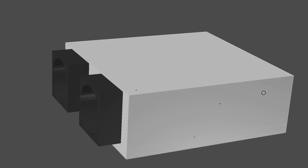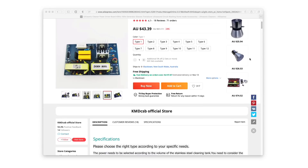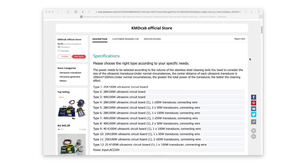One suggestion was to improve the cooling of these drivers by placing them into a smaller box with fans to create more targeted cooling. So I 3D printed a box, put two small 12-volt fans at one end and some vents at the other end, creating a wind tunnel. This was effective in bringing the operating temperature down, but I was still having failures, and some drivers were getting hotter than others. So I decided to try some different drivers. I found a new seller on AliExpress that sold transducers and drivers separately, so I bought a couple of drivers to test them out.